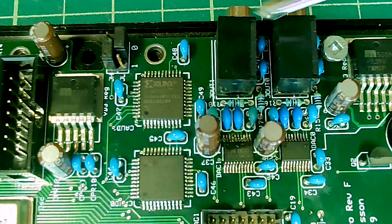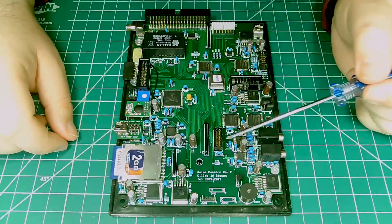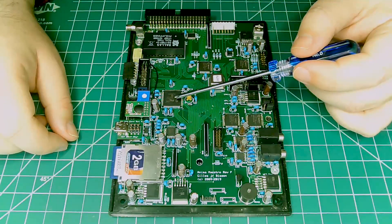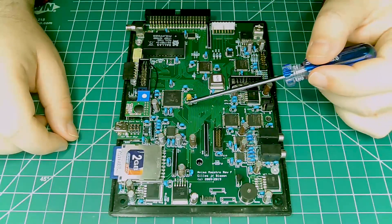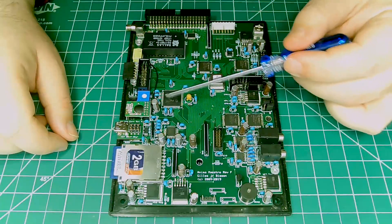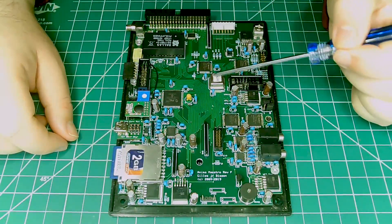The next important thing was to be able to play the audio soundtrack of my animatronic, which is why I included a stereo digital-to-analog audio converter — a DAC. In fact, I included two. One thing the microcontroller I chose was lacking was the ability to talk directly to audio DACs using the I2S audio protocol. So I needed to add the third and fourth CPLD devices to synchronize the audio data coming from the microcontroller — running on its internal clock — to the actual sample rate of the audio DACs, derived from a dedicated oscillator.